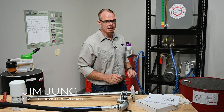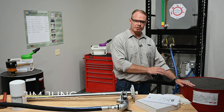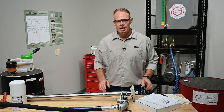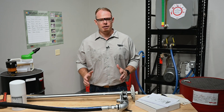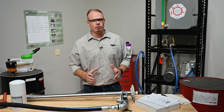Welcome back to Trico's maintenance room. Yesterday we received a barrel of gear oil, took a sample from it, and sent it off to our lab. We just got those results in and the ISO cleanliness code isn't exactly where we'd want it. We came back at a 22-20-19, which means we're going to have to clean this up a little bit before we put it into service.